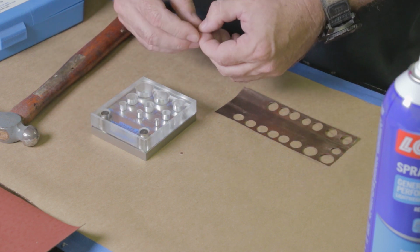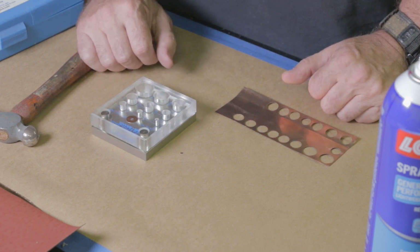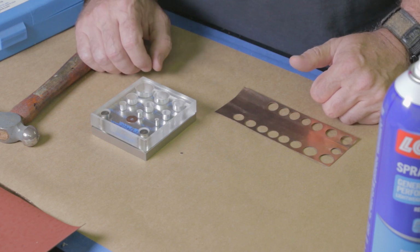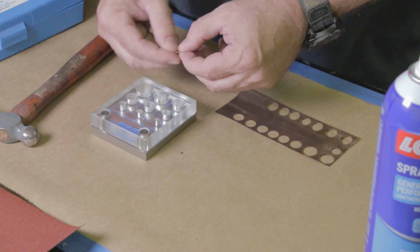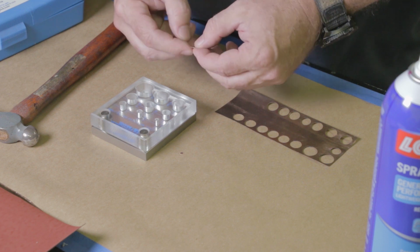So, and I'm okay with that. I will put 2 different size shims on the knife to encourage better centering. Because generally what happens is the lock tends to put pressure on the blade when the blade is closed, and it wants to push it to the off side. So if you have a larger shim on the off side, that kind of helps resist that torque that's trying to push the blade over. Just something to think about. I learned that tip from Johnny Stout, so I want to give him a shout there. But I think it helps, and I've seen the difference.